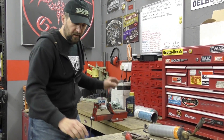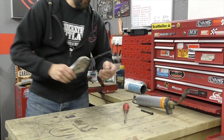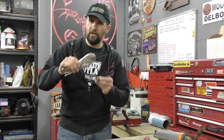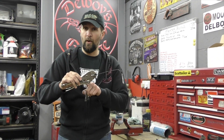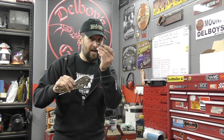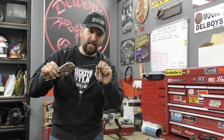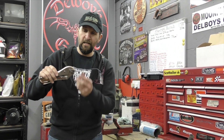Now I'm going to take this piece of steel. I've prepared it for heating — I didn't want to put it straight in the jaws of the vice grips because these are stone cold, and as I heat the metal the heat will get drawn out of it and into the pliers, making it struggle to get up to temperature. Instead I'm going to heat it on the end of this hook — squeeze it in, not too tight so it won't come off, so I won't drop a piece of red hot metal on the floor. It's all nicely contained so it'll heat up quicker. Let's get the gas on and start heating up.